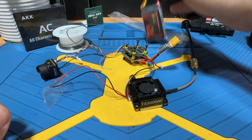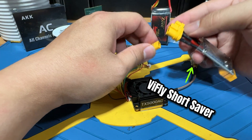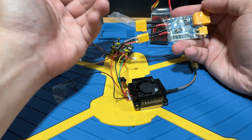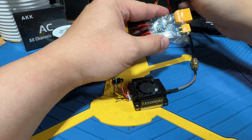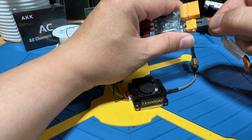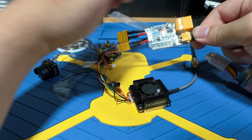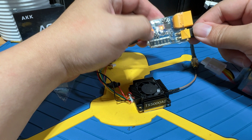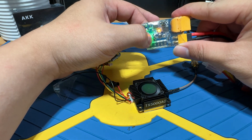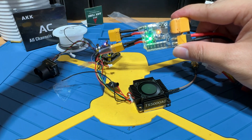We can plug in our LiPo, but as a precaution we're going to use a ShortSaver. The ShortSaver acts as a bridge between your LiPo and your hardware — if something is shorting on your equipment, the indicator will go red. Press to power on. It should stay green; if it turns red, something is wrong.